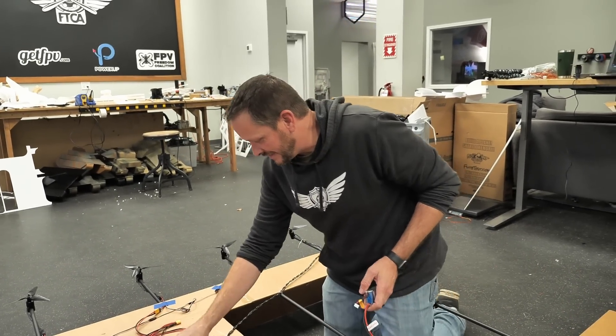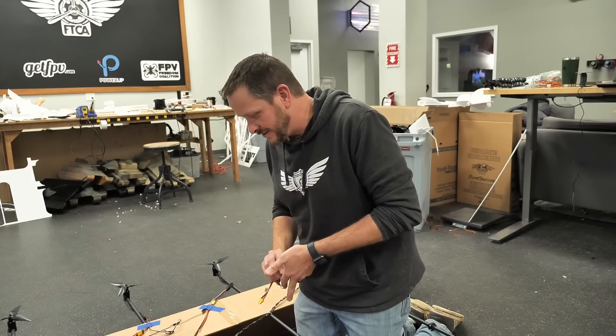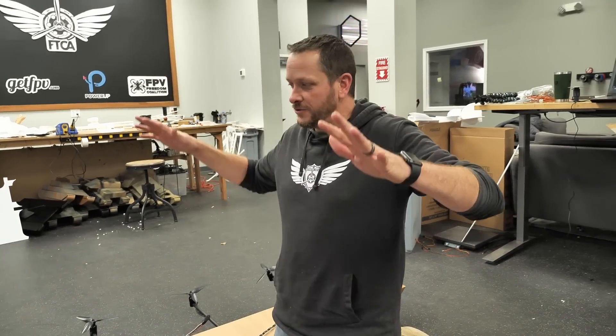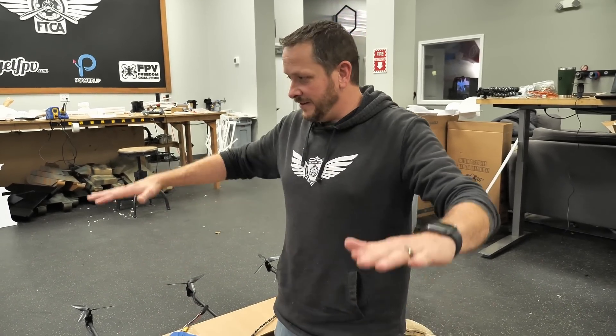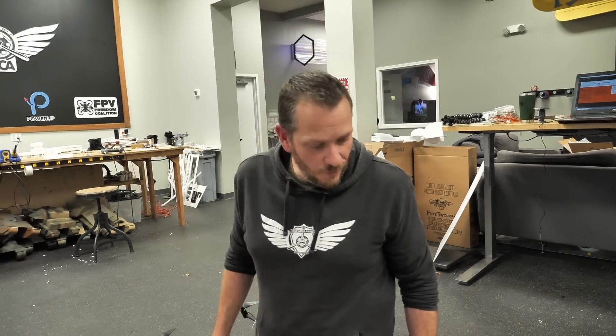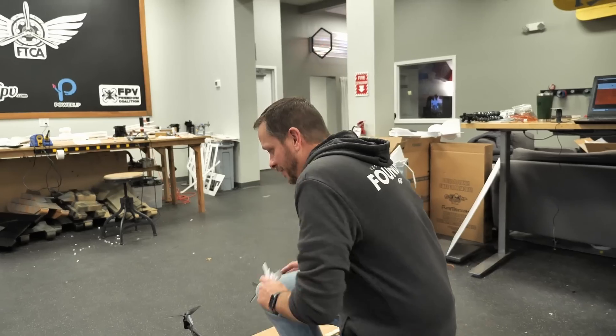Before we take it outside, I just want to see how it runs. You can tell a lot by when things hop in the air and how it runs away. One good thing we have going for us is it can't oscillate itself out of control because the majority of the lifting is just on throttle. So all I want to see is: will it lift up? Is the gyro going to be enough to make it stable? I just want to make it light at first to see what it does, and then we'll know if we have to brace it.